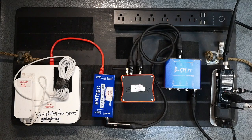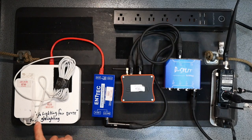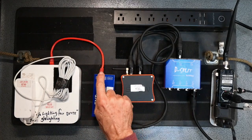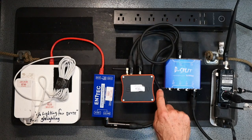This is my older wireless DMX system. I just want to show you the signal flow, and then I'll show you where things have gone in the last couple of years to make this system much smaller. This fits in a Pelican case, and it starts out with a Wi-Fi network — an Airport Extreme — with the network name and password written on it. Then the signal comes out of the LAN port and into an ENTEC OpenDMX Ethernet box, which creates the DMX signal. The DMX cable comes out from a 5-pin DMX output.